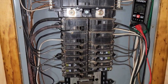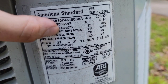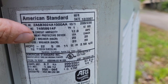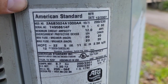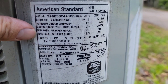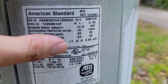Let's go check out the air conditioning system and talk about breaker sizing. The outdoor unit is actually on and working. You can see it is rated for a max fuse/breaker of 20 amps, so that 30 amp breaker is a little too big for this unit. The wire is fine — this unit could use number 12 wire, but it's got a 10-2. The max fuse is only 20, so it really should be a 20 amp breaker installed in place of that 30. You always want to look at the data plate and see exactly what you should use.